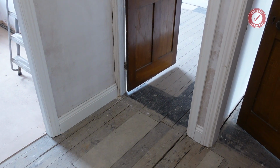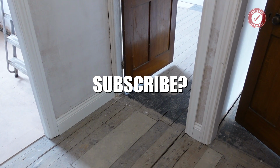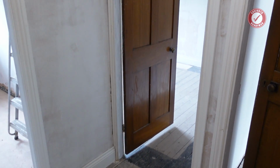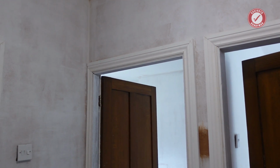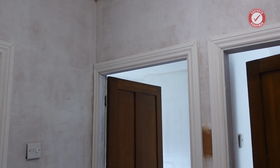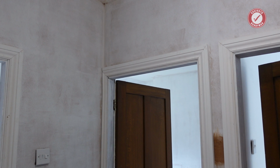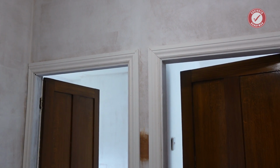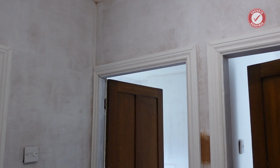As I say, I've started on the skirtings as well, but we're going to save that for the next video because there's a lot to cover off on the skirting board side of things. And by the way, 100% pre-assembling your architrave sets with CA glue is by far the easiest way of doing it. It really didn't take long. Probably took about a day all in to do all of the architraves. I mean, it was split across 2 days, but it was like 2 half days to do all of the architraves in the whole house. So, day to 2 days, pessimistically, but the architraves are relatively easy in the scheme of things.